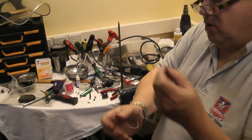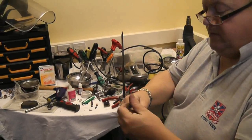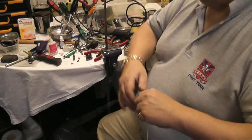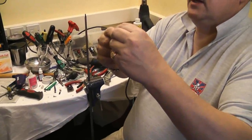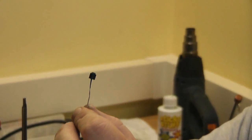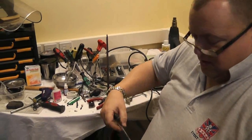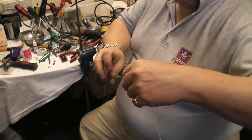Ease out the wire and straighten it. With the Leon Paul wire it's a loop, so I tend to make my life slightly easier - break the loop off. What I've done is carefully squeezed together the two wires so they come in at the centre, and I've put some nail varnish on to add some additional insulation. This is where it gets interesting because the two wires end up wrapped around each other, and if you carry on pulling it tight you can end up with a kink in it.